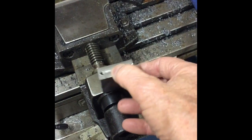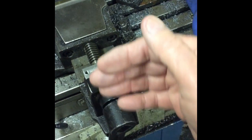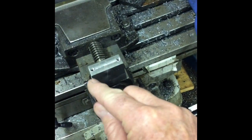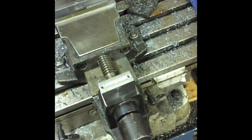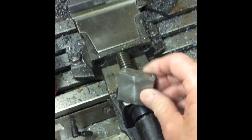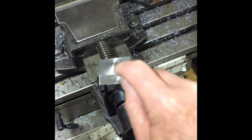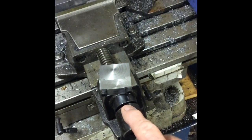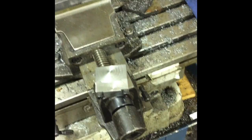Also from the top to hold it — if that doesn't work or if it gets too much sideways movement, I can later put a small piece of steel on both sides, but at this stage I'm not going to. That one's done. Next thing on this: I've got to pick up the center, drill it for 22 mil, then split it, and then build it up with bronze welding.